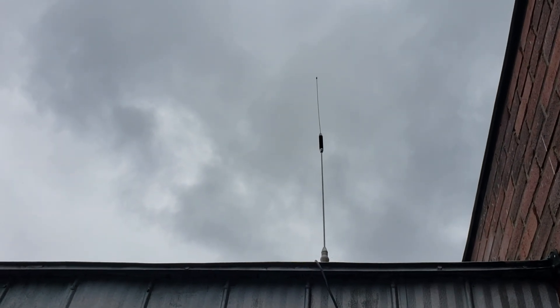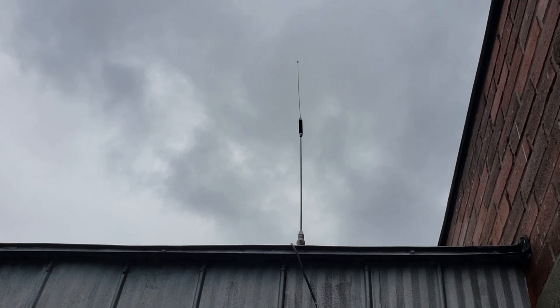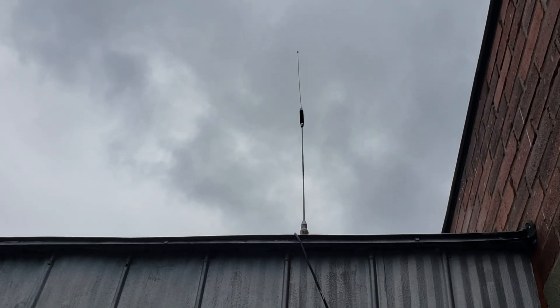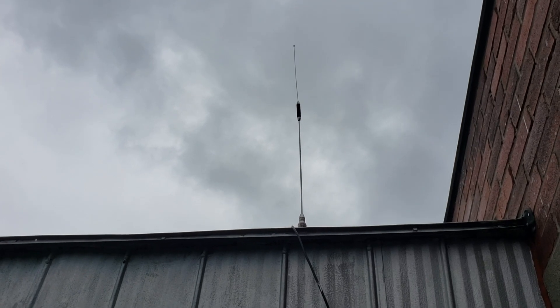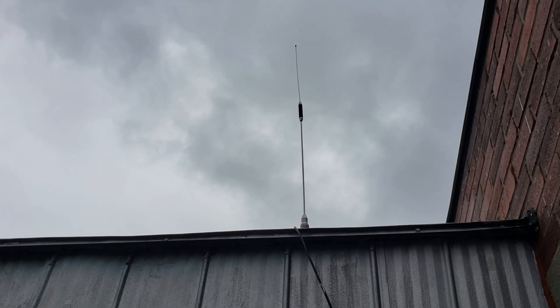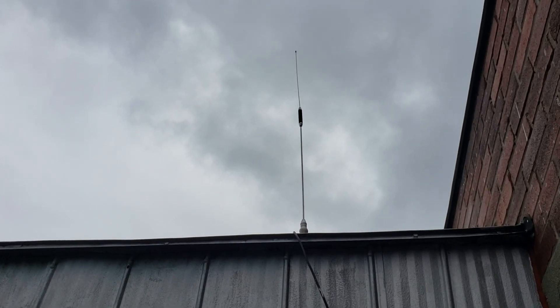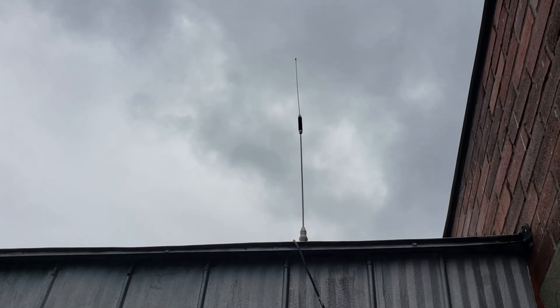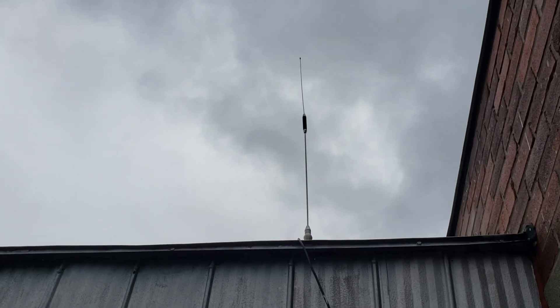So that's my mobile vertical for those who have been asking. It's a wideband antenna rated from 30 MHz to 1300 MHz, and it's also rated for transmitting on 2 meters and 70 centimeters, making it suitable for amateur radio operations on those bands. If you enjoy my videos, please subscribe and give us a thumbs up — thank you for watching.